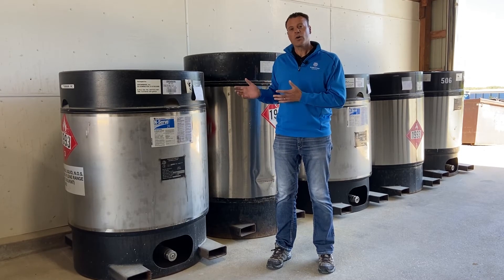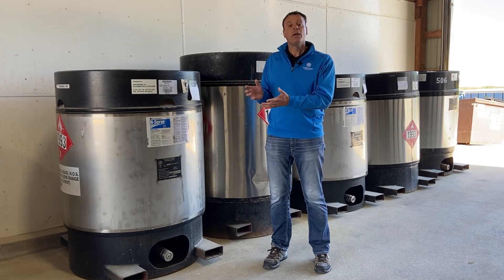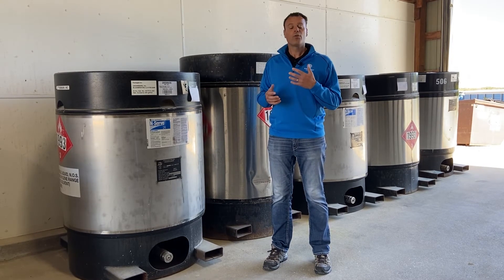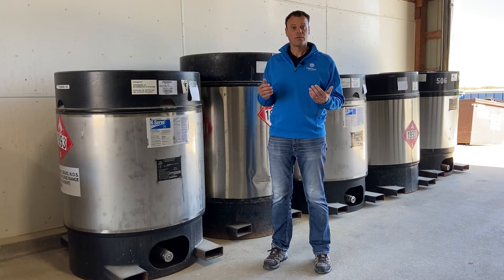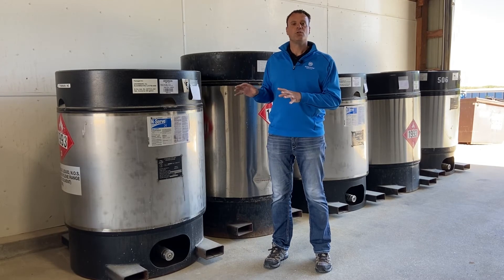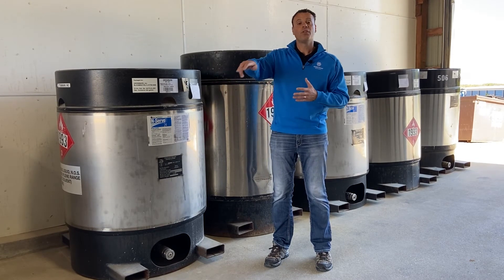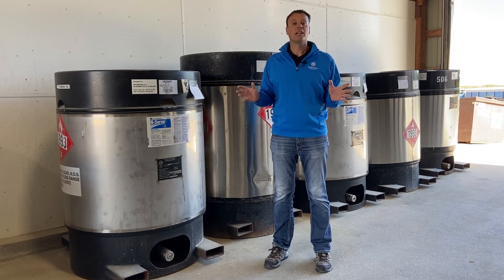When we get in season, you also want to think about where these mini-bulks are going to be. Some people will have the mini-bulks and the pump near the riser — the riser is where we put the anhydrous in the nurse tanks. When you have the mini-bulk tanks out at the riser, you've got to think about what are the temperatures and conditions. What I would prefer is to have the mini-bulk tanks somewhere indoors under roof so they stay out of the cold temperatures and out of the rain — you're going to have fewer issues with your tanks and pumps. Most retailers I've seen put the ammonia in the nurse tanks at the riser and then pull the tanks near a building where the mini-bulk tank and pump are indoors. That prevents a lot of headaches.